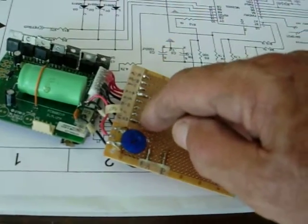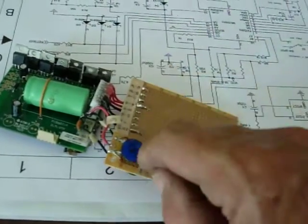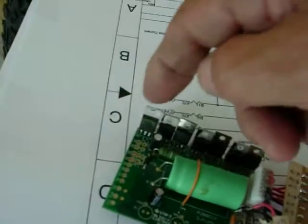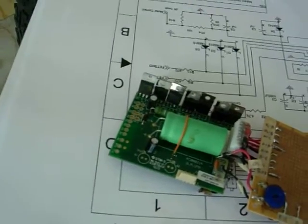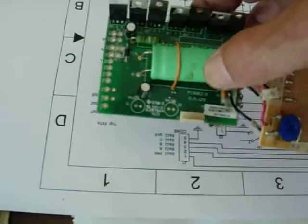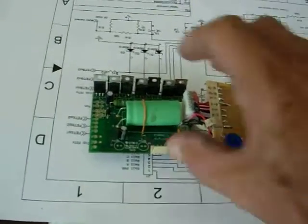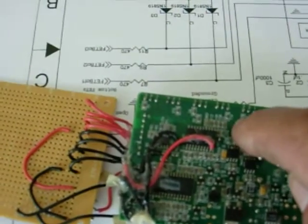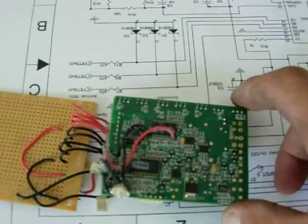I've got my hall connections, my motor connections, and my speed control is a little pot here. The enable line is going to have two switches. The main power connects over here — I'll put a switch in that power line at 24 volts and ground. I looked closely at this board and there's an air space showing the different ground planes — I used that as an example. I also found their resistors near the FETs in their schematic showing where to put those, and that told me where to put mine. I basically copied their idea.